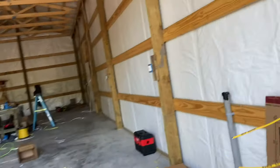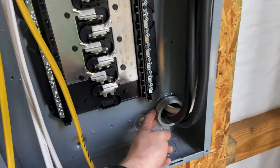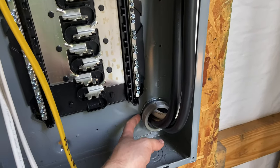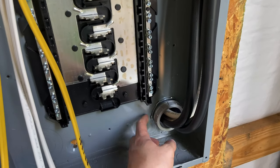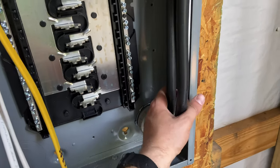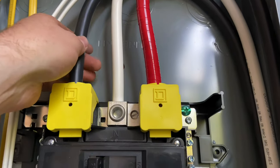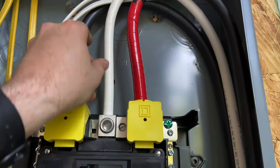You've seen this panel before — now with more wires. For the inside, we did what's called a back-to-back mounting. We've got a two-inch hole going out to the building, and there's a piece of two-inch PVC conduit connecting the two boxes. We use a lock ring as well as a plastic bushing, which is required. Then we've got our conductors coming in — you can see they go right in the top. We've got our first phase, our second phase coated red so we know what's what, and then our white neutral.